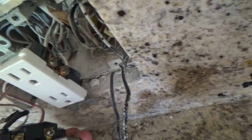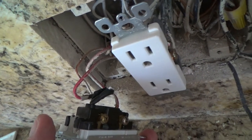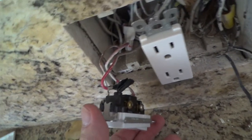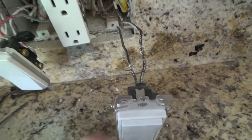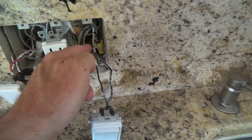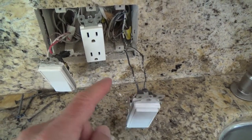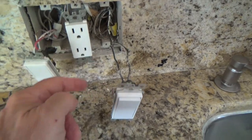The ground wire screw has a little copper wire on it but it's been snapped off — there's a ground wire in there I'm gonna have to fish out. This switch here has a ground wire — it's generally just a bare copper wire. They got these plugged into the back and for some reason put black on them just to show electricians later: hey, there's power to that, it's not a white wire. So I'll have to fish that ground wire out.